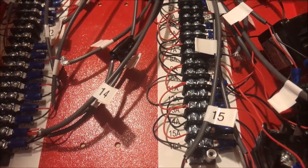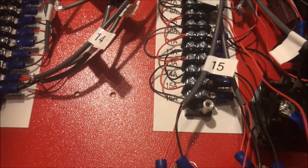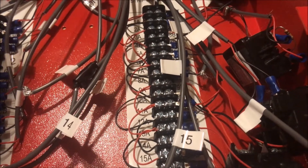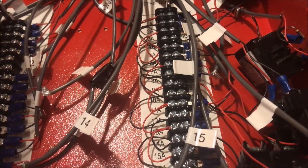Every point has its own set of wires — no two points are tied into each other. So if I need to disable a pull station, I come in here with a screwdriver, undo the spade terminal, and then that pull station doesn't have power. I can work without having to completely shut down and disable the entire panel.